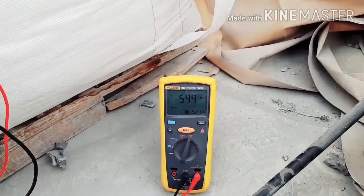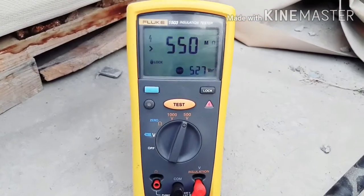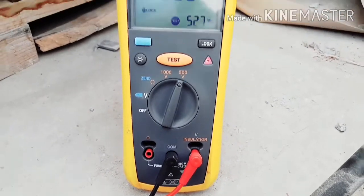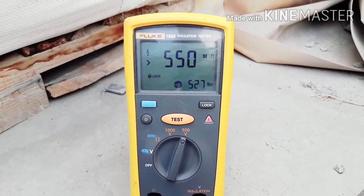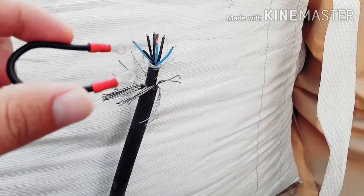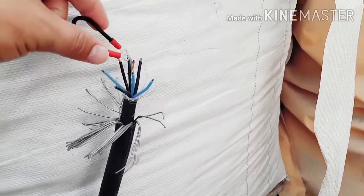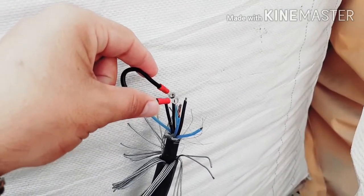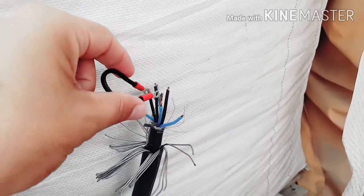You can see these are the main cables we are testing — insulation testing. Be careful about the supply voltage according to the specification. Do not apply more because it will stress your cable and damage your insulation. First of all you should de-energize your cable — I have already de-energized it — because there is a risk of electric shock to any person. Safety first.